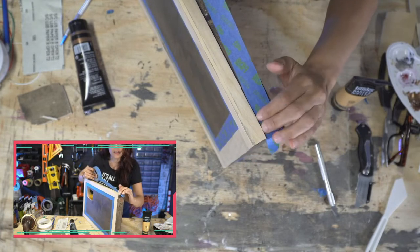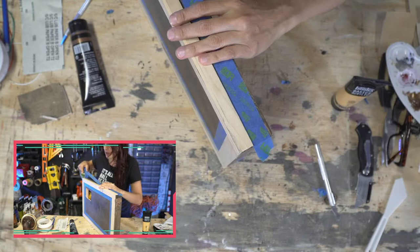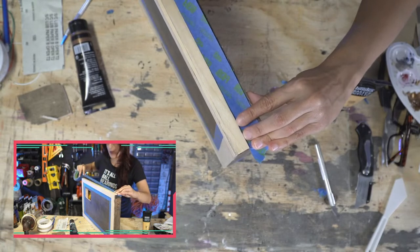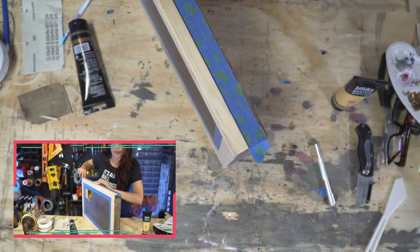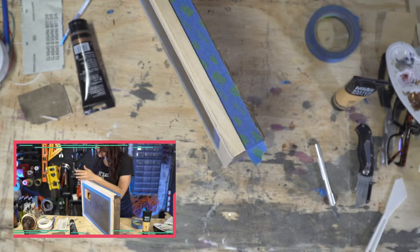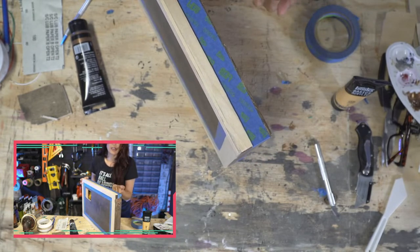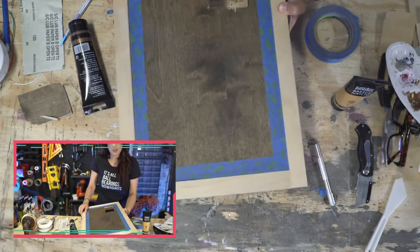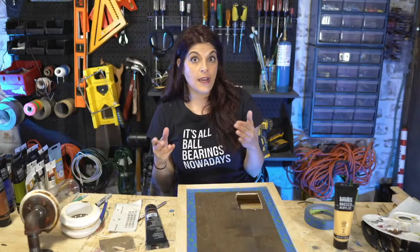I like glue, but that stuff supposedly... I lost my train of thought, but we were talking about that plastic glue, or plastic wood filler. Supposedly, it's very stainable. Obviously, no putty or sandable wood filler is going to give you the exact same stain color, but some do a much better job than others. When I was using it along these seams right here, it's very gritty. It's almost like you're rubbing wood dust on it. A lot of fillers have that quality, but this one was especially wood dusty. And so I'm like, wow, this one might actually be stainable.